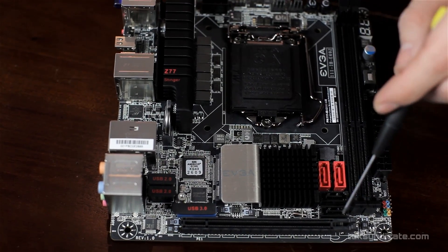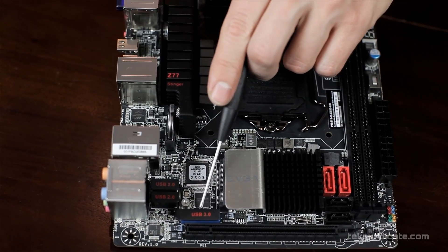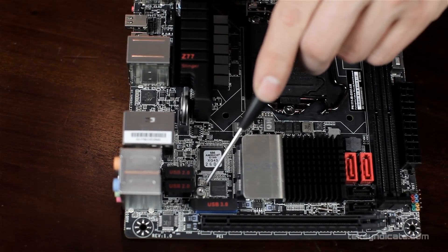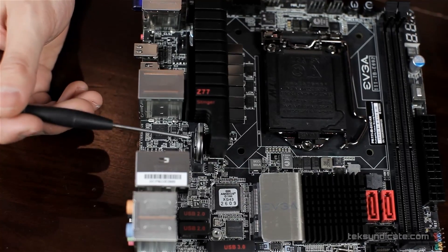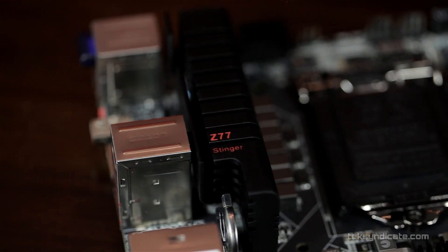Moving over, there's your 16-speed PCI Express slot. Just above that, we have USB 3 and two USB 2.0 headers for your front panel. On the back beneath the brushed aluminum EVGA symbol, there's a mini PCI Express slot that can support industrial MSATA solutions from brands like Kingspec or Jetaway — Jetaway also makes a dual gigabit NIC card for that slot, which is pretty cool. Note that this board does not come with Wi-Fi onboard, so that mini PCIe slot is handy for adding it. Just beneath that is the CMOS battery, mounted vertically to save space, fitting right beside the heatsink over the voltage regulators.